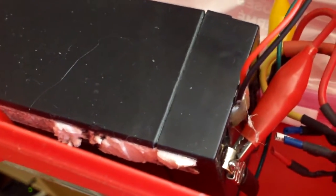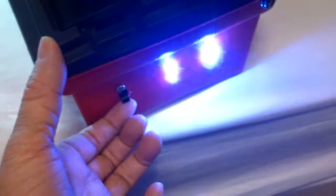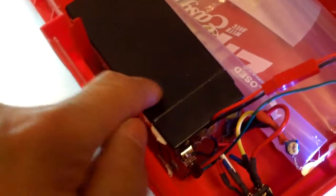It's pretty much charged at 6.6, so it looks like it's working. This is the solar utility box I just finished making, with LED lights on the front of the box. The solar panel hinges and the angle is adjustable — it's a 1.5-watt panel, 12-volt output, putting out about 18 volts, and it charges a small 6-volt battery.